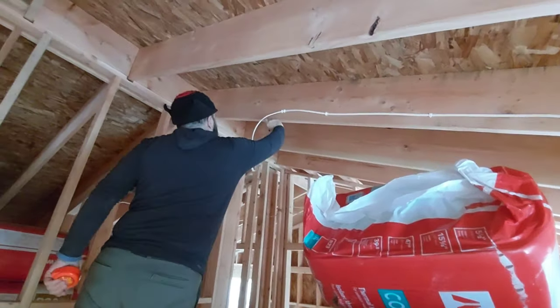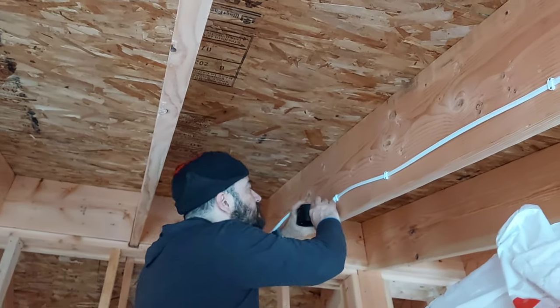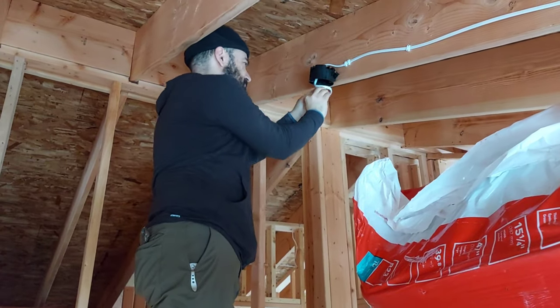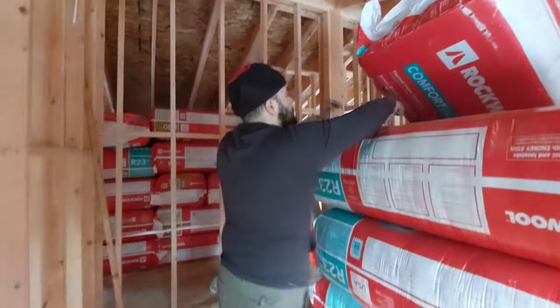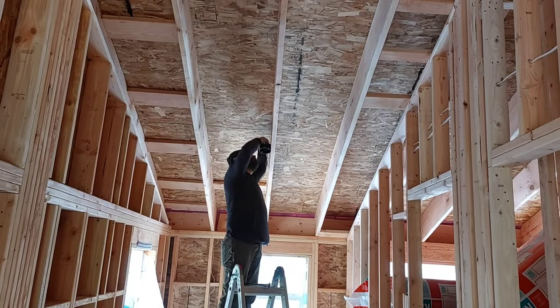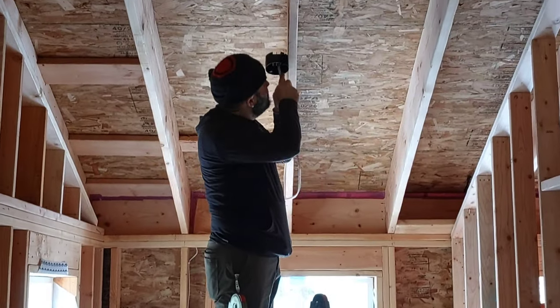The rough wiring was doable. The challenge was to find a path through the non-structural elements of the house. After securing the wires to the studs or joists, I have installed the gang boxes for the switches and the ceiling lights. Now I am moving to the switches — I'm going to install them and probe them to be sure they are working, installing temporary lights on every line.